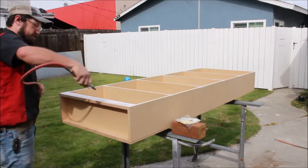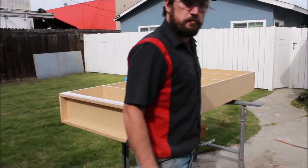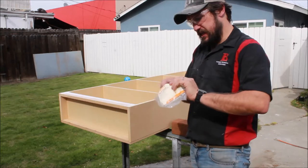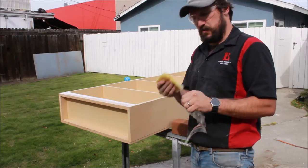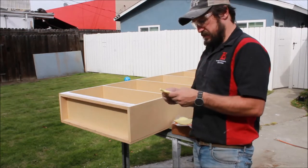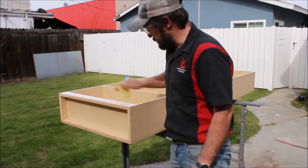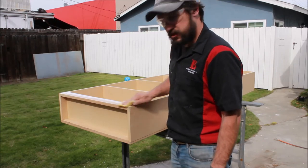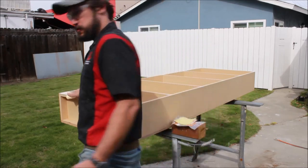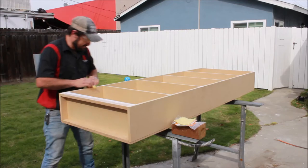Now it's time to clean up a little. Air compressor here — we'll spray it off once more before we paint, but I just wanted to get the loose dirt off. And then use what they call tack cloth. Tack cloth is kind of a cheesecloth that has a bit of a wax coating on it. It's slightly sticky but it doesn't leave residue on your project. I'm going to use this tack cloth to pick up the dirt that the air compressor wasn't able to blow out, so this will roll across your surface and pick up those last remaining particles that you don't want sticking in your paint.